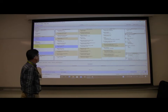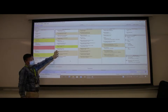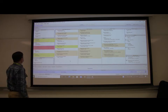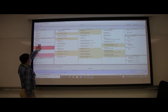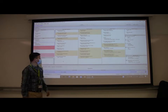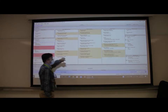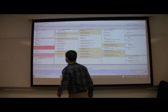This is the interface of commissioning. Here you can see the program is running in the system. Here we'll show you like the damper. Discharge air velocity pressure now is zero because the blower is not started yet. The occupancy sensor, we use a bag to cover the occupancy sensor, which is unoccupied. The output mode is unoccupied. The light is off.